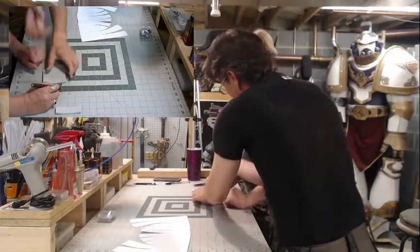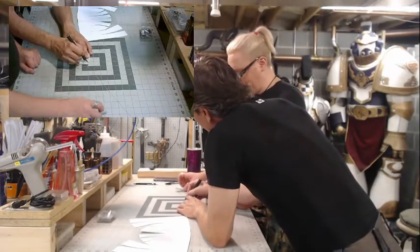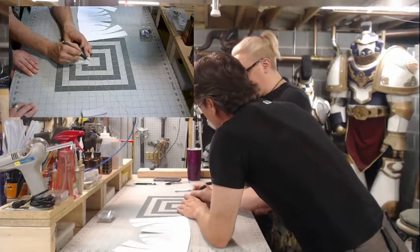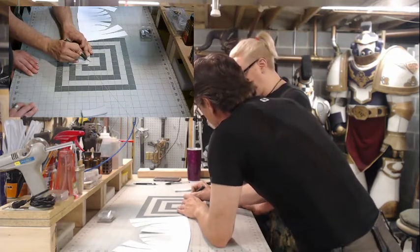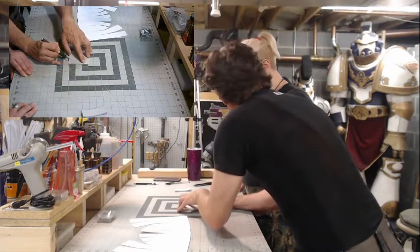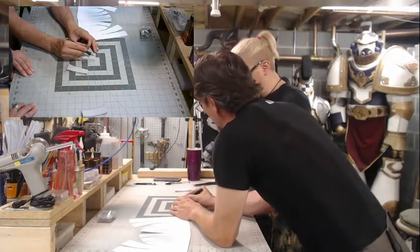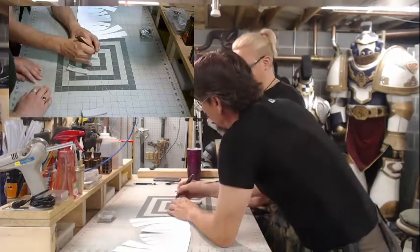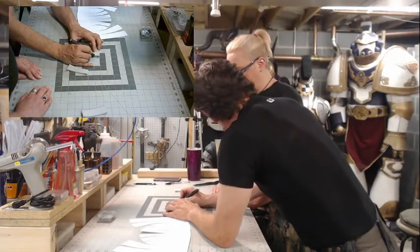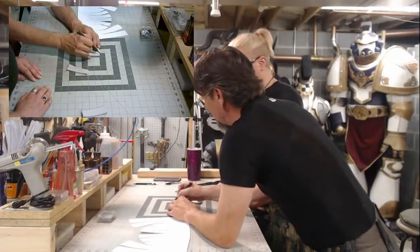when you're cutting, if I may. I don't know, is it safe to give it to you? Yes. I typically cut like this, but you always want the blade to do most of the work for you, so you can actually pull it at a little bit of a shallower angle, and you're still getting that straight line. You're just using more of the blade to cut. So when you were cutting, you were kind of cutting like this. You can actually do it like that, and you have more of that blade surface cutting.